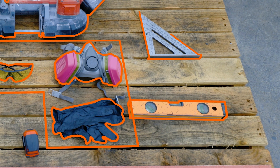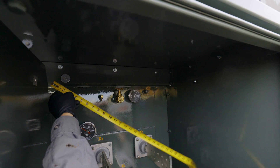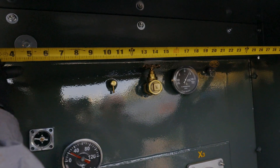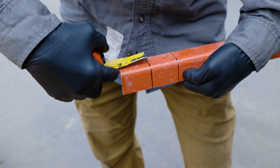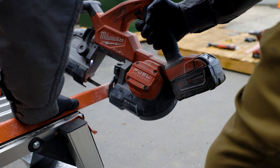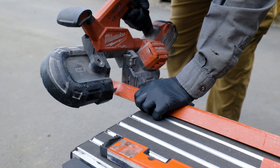A level and a speed square is also useful. One of the first things you're going to want to do is measure the width of your cabinet. Ensure that the height of that brace is not covering access or viewing to any of your gauges. In order to attach your cross brace, you're going to need to cut two pieces of angled glastic for it to attach to. In this case, they're two inches wide.